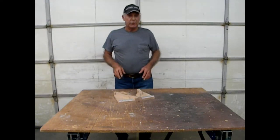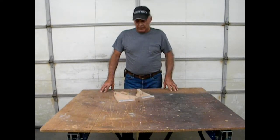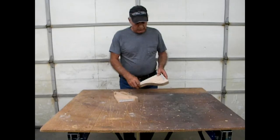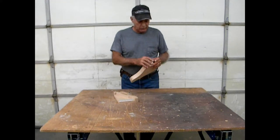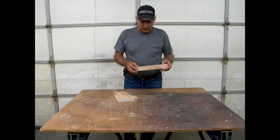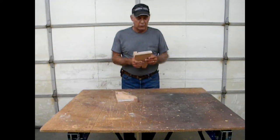I apologize — I started editing this video last night and didn't like the ending, so I came out this morning, set everything back up, and we'll complete this project so you can see a fully functional gun concealment corbel. As I mentioned, we want to attach our two interior spacer pieces and glue them into position. When I glue these in position I apply the glue, set them in place, make sure everything is flush, and let it set a couple minutes before clamping — that way they don't slide around and I keep the alignment I want. I decided to use angle aluminum to hang this from the underside of the shelf.